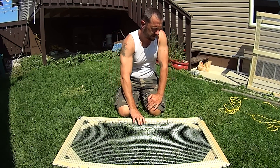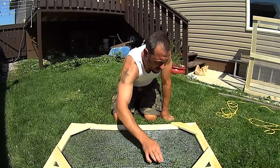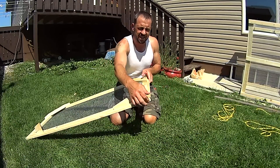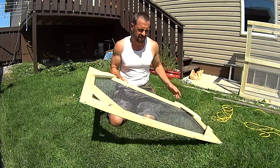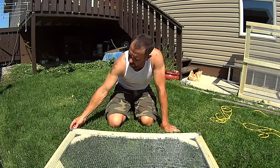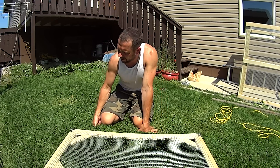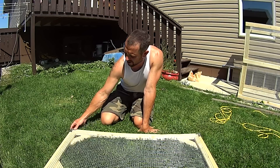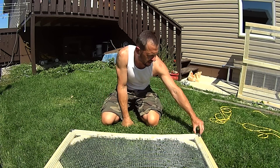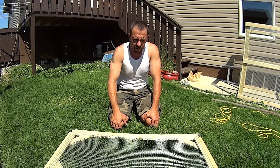Here's how I've set up the door. Basically what I did was put these little crossbeams in with a couple of screws on each one, then screw the angles in — one for each angle. That fixed the door. Then I flipped it over and put in my hinge hardware already, so I know where it's laying in relation to the mesh. I put the hinge on first, then cut out and tacked down the mesh. Now this is going to be ready to hang — I'm just going to hang it by the hinge, fix the handle, fix the lock.